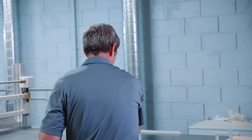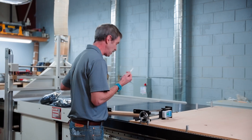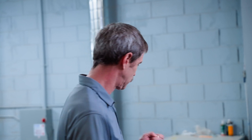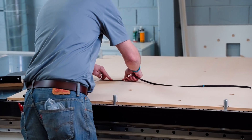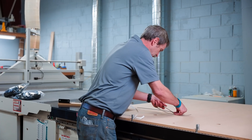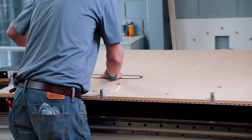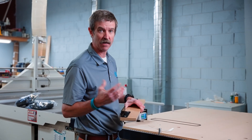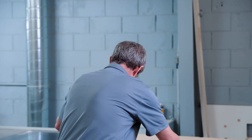Now what we're going to do is take our onboard gasket material. This is 1/16th inch thick — we've got a few different varieties of thicknesses and densities. With this 1/16th material, we mirror the same size as your part, just the inside of the toolpath. We lay the part down on top of this gasket ring, and we're able to create a negative air pressure differential — creating a clamp on the part, different than just downdrafting.